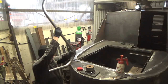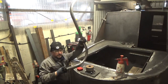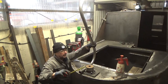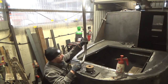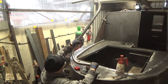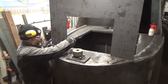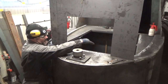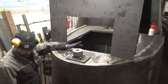Okay, so we've got the tiller. That's the boss that gets welded on the end. This is too long so it's going to be cut down — I need 260mm from where I've cut it off, and it welds onto that. It protrudes 260mm out there and up the centre line. We need that distance to clear all the way round.